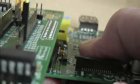I'm going to try it out now. So here I have the new ports all wired up and ready to go. I've got them wired up to a little surface mount LED board that I've made. On the other side there's a Darlington array. Each GPIO port is connected to an LED.